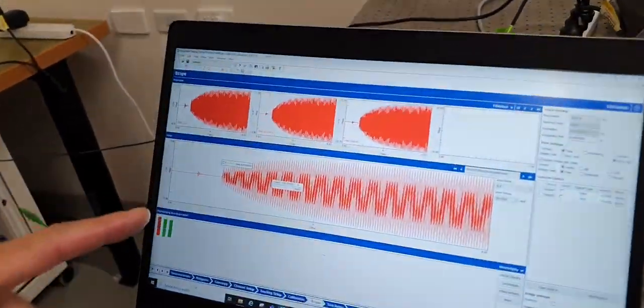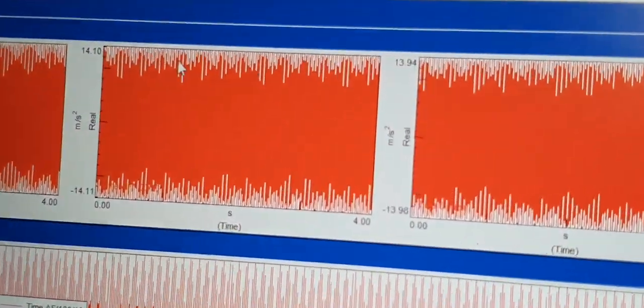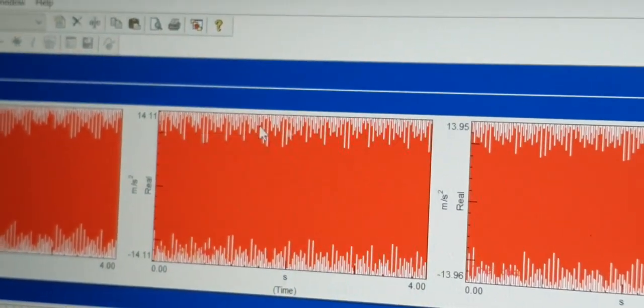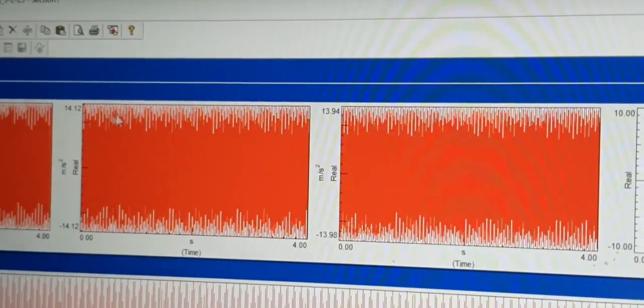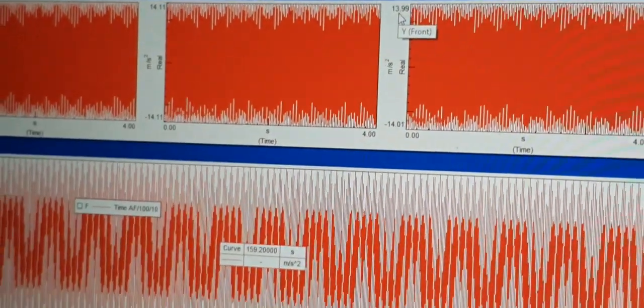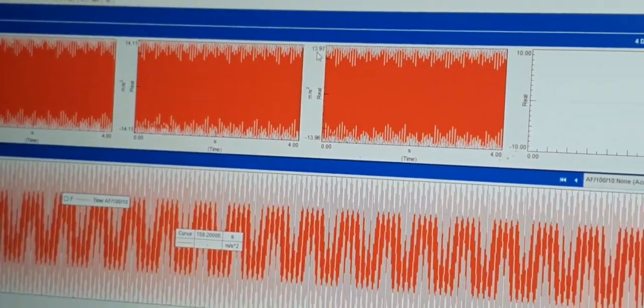And we have a look at these two measurements, and they should be, once it builds up fully, pretty close to or exactly 14.14. They fluctuate a little bit because there's noise in the environment, the table's moving, they differ a little bit from one another, but they're now pretty close and pretty closely calibrated. That's a relative calibration process. That's the end of this video.